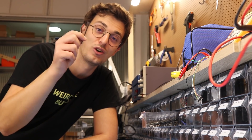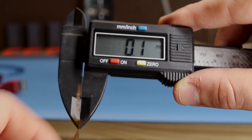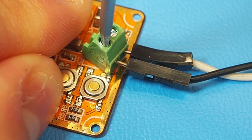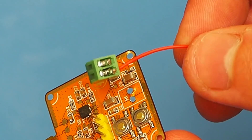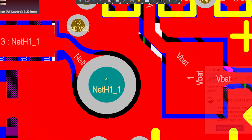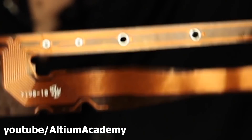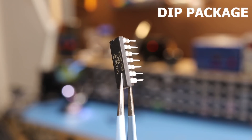The next thing to look out for is through-hole components. Given that flexible PCBs can be as thin as 0.1 millimeter, through-hole pads are not going to rigidly support the pins — any flex can easily break the pads. There are some solutions like teardrops and tie-downs that can provide additional stability and prevent breakage. I suggest avoiding single-row through-hole components; you can get away with multiple rows since the component will be more rigid, but when possible I prefer surface mount.